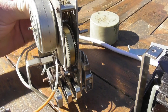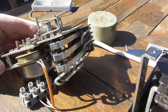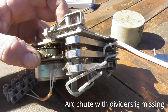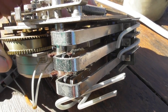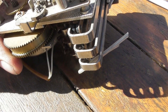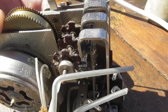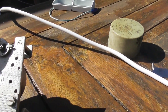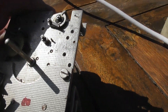And now the motor itself — this came out of another clock and it's got a three-phase contact in here. Close, open, close, open, close, open — so this is just a three-phase contact. The actuators are just fiber gear wheels. The mechanisms have date codes on them — this clock was 65.12, so December 1965. The other clock was 1962.